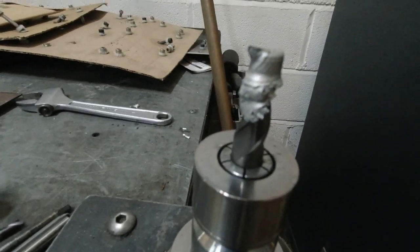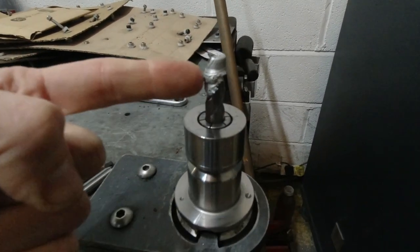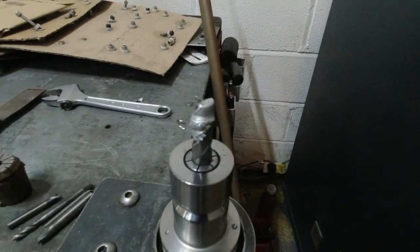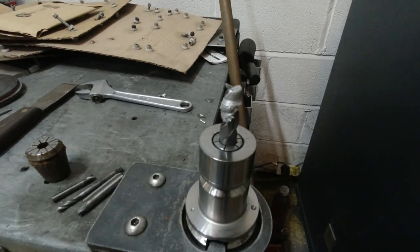This is something we don't want to see — this is called chip weld. The 12mm end mill has chip welded whilst we're making the AF-16s. The tool broke and chip welded the 12mm end mill.